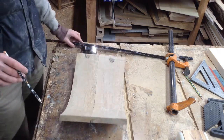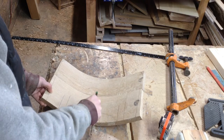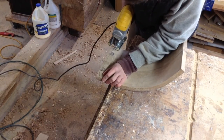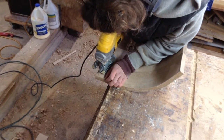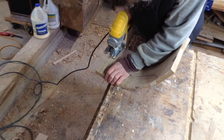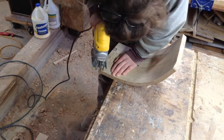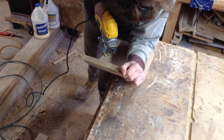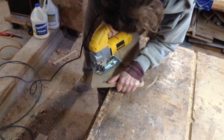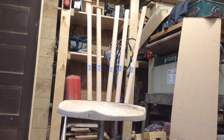To start the backer on the chair, the edges in the photo are cut at an angle, so I added a slight taper to the edges, rounded over the top a little bit, and then used a compass to draw an arc in the center. I jigsawed all of that out. You can see on the edge there are some marks from my clamps — that's from the steam bending, the clamps left an impression in the wood because I didn't use a wooden block. After the jigsaw I did some sanding on the backer just to even it out, but I was waiting until the end to do the final sanding mostly.